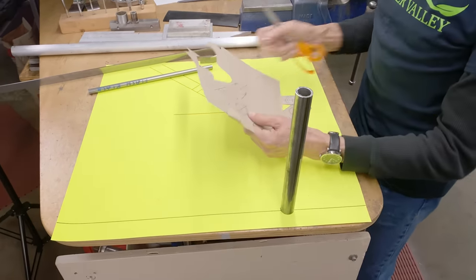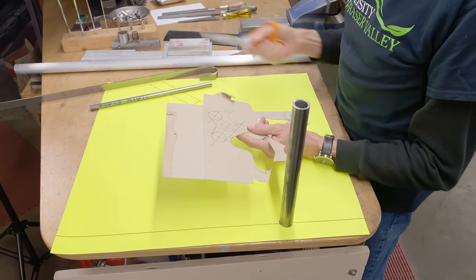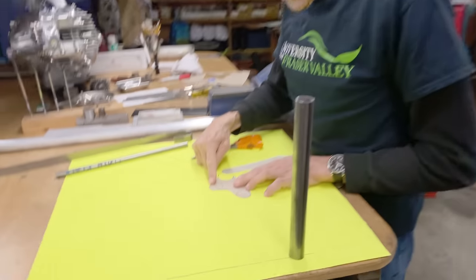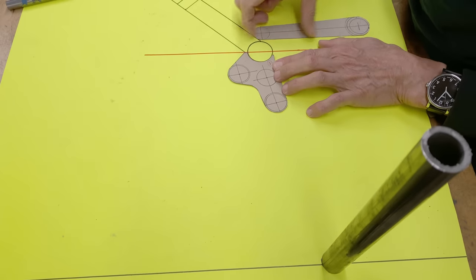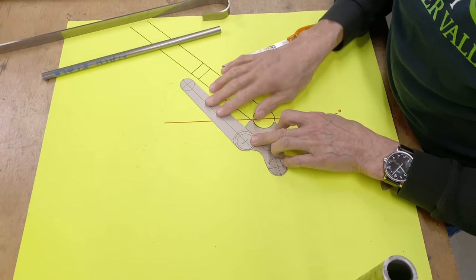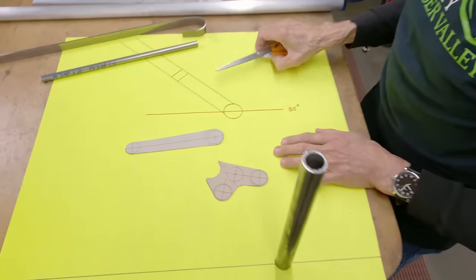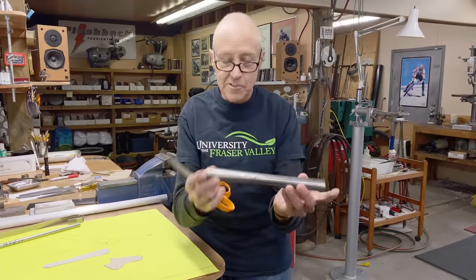Here is version three. Let's just cut this out and make this out of this piece here. This only has to be on the left-hand side. This piece aims down towards the cross tube and then bolts onto one side, and there's a hoop over there. So let's have some fun and make some stuff. We'll go to the lathe, face off the ends of the tube — this is heavy wall tube, nice and strong.